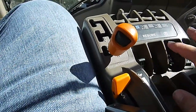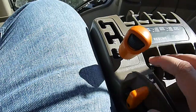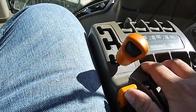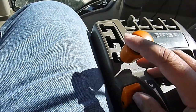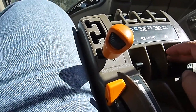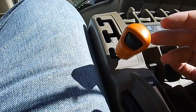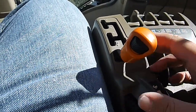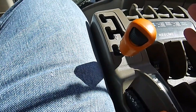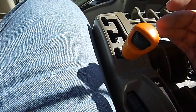For this cruise control to work, the throttle's got to be wide open. If you're not at full throttle and try to turn it on, it won't turn on until you bring it all the way to full throttle, shut it off, and turn it back on again. You're pulling into your cut — you can either hit your switch again to shut off the mode, or you can cut your throttle back about halfway and start downshifting into the gear you want to be in for your cut. If you don't pull the throttle back and you start downshifting and shut off that fuel efficiency mode, your engine's going to run wide open and the tractor's probably going to try and take off on you. So it's best to roll that throttle back and then start downshifting, so the scraper doesn't get away from you.